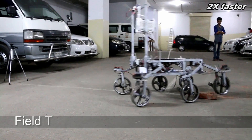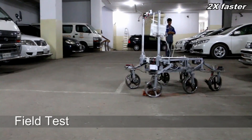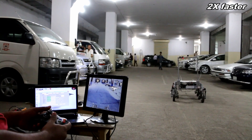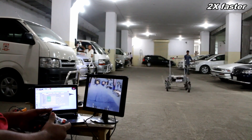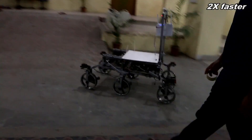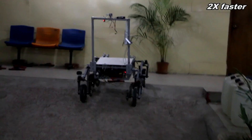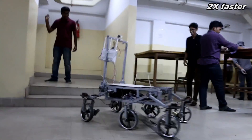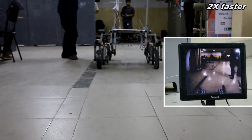We have used one Raspberry Pi for the video server and another for the rover control and sensor data analysis. Wireless data transmission is done by implementing a client-server application through a WebSocket server. If the server disconnects during tasks, it can auto-reconnect within 500 milliseconds. Using data from the GPS and gyroscope sensor and offline maps, we can create a 3D graphical view of the terrain.